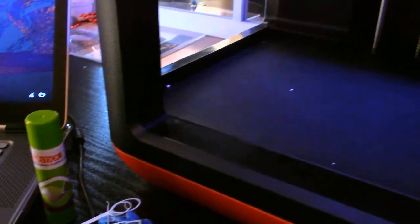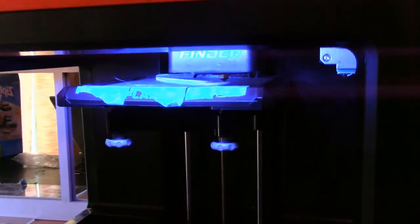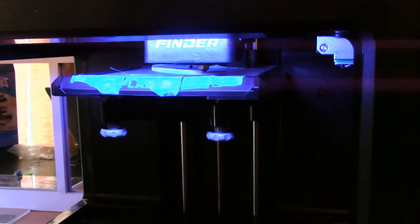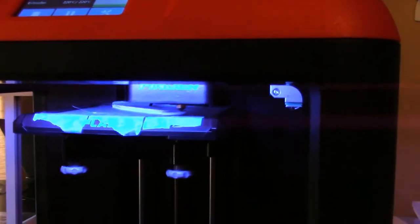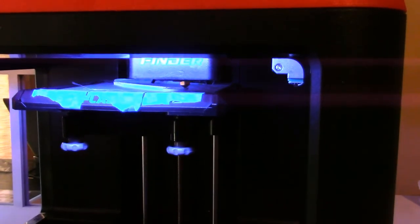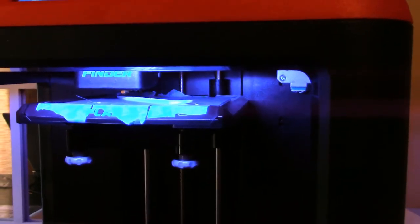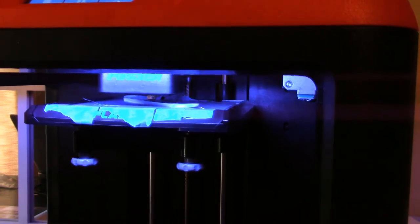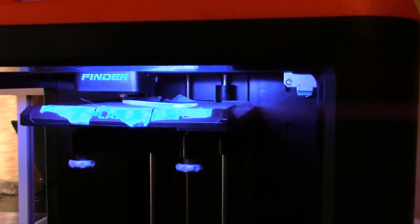when you're printing a project so it doesn't warp. And I just found it kind of made the bed a mess. And what I read somewhere, someone suggested that you take the bed and you flip it upside down so the plain glass surface is exposed, and then you use just regular blue painter's tape, cover the glass in that blue painter's tape, and it gives you a good surface to print on. So I've been trying that on my last couple prints, and it seems to be working pretty well. Not perfect, but pretty well.